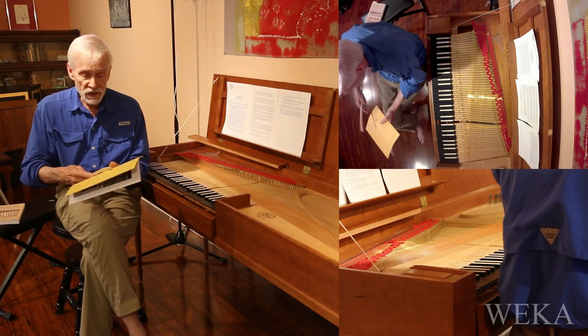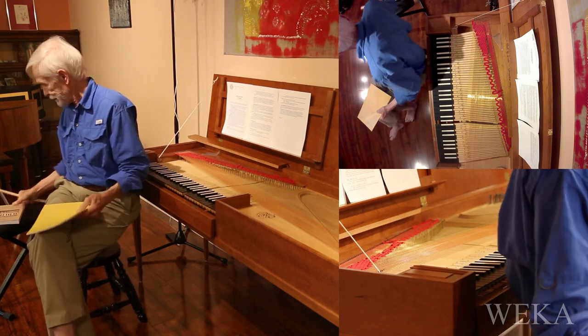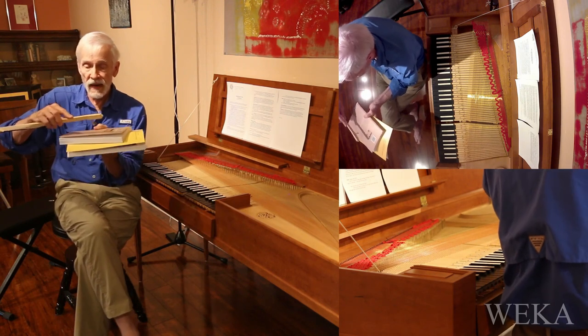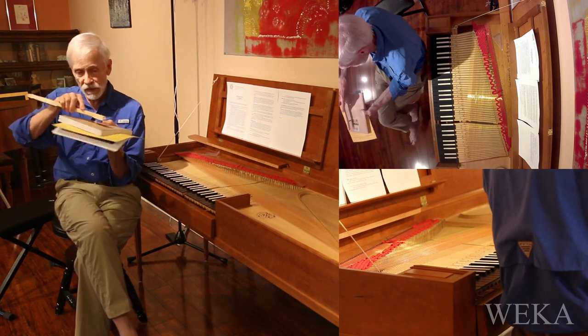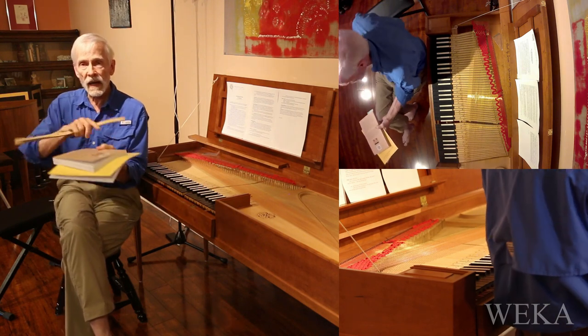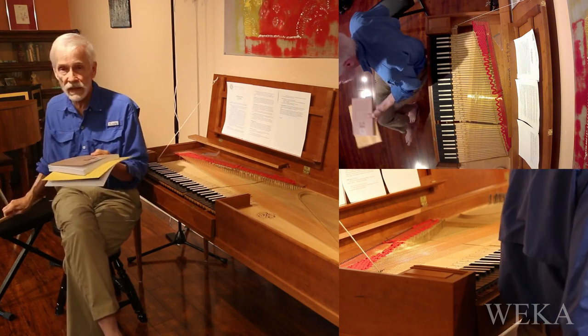But for the easier stuff, just have a good nice rough paper or something, and you just take that like I did with the filing. You just rub that top where you're perpendicular to what you're doing, and then just round it over a little bit to make sure all that oxide is gone. And you're back to nice fresh metal.